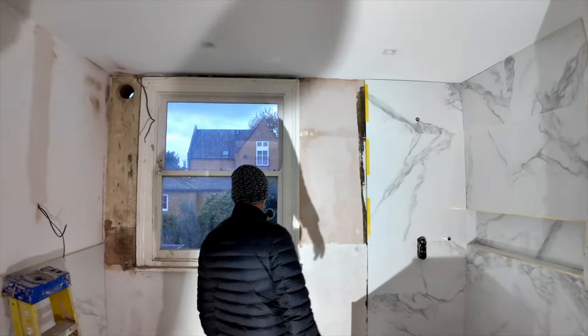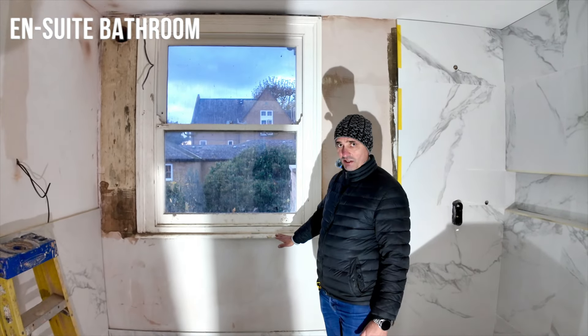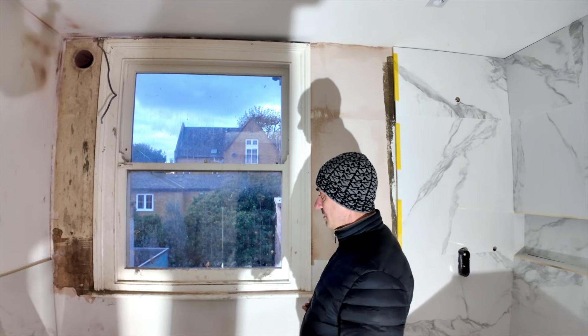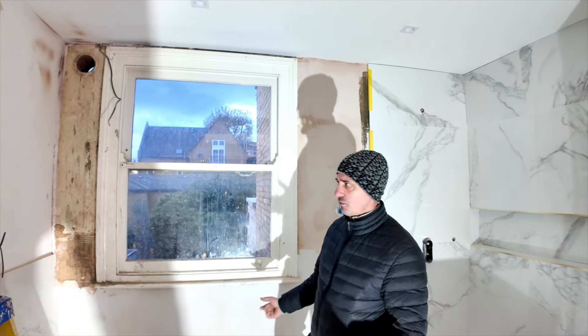To deliver something very professional at a high level — South Kensington, High Street Kensington, Knightsbridge — you have to do that on houses like this. Here you can see we need to put these tiles. The reason I haven't fitted them yet is because I'm waiting for the window to be fitted first. As soon as the new window is in, I'll do the tiles, because if you take the window out there's a chance of breaking the tiles which are very close to the window.